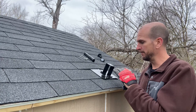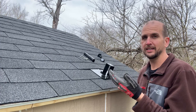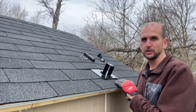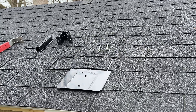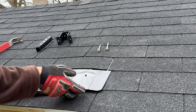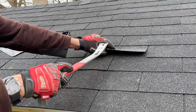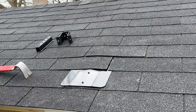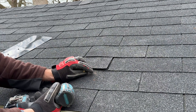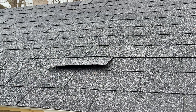Let's go ahead and start getting these installed. I'll also let you know what happens when you think you've found the rafter, get your lag screw sunk in, but — especially inside a shed where you can see the decking — you see it actually missed the rafter. There is a tip that lets you avoid moving your mounting location and still get a secure hold. I'll take my measurement, checked inside and transferred outside, accounting for the overhang of the asphalt shingles — that came out to 26 and three-eighths inches to get the exact middle point of the rafter. I'll check for any nails and remove any that would interfere with the flashing. If you want to verify, go up under that course of shingles and drive a screw in to check for resistance — if you're getting resistance, you're hitting the rafter. If not, that hole is easier to seal because it's underneath the shingle.